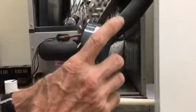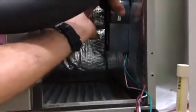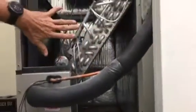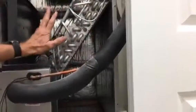What you could do is come over on this side and drill your hole. You'd have this self-cleaning unit inside — as the airflow comes up through here, it'll hit this goal-post design and go through. This unit will actually clean the coil all the way through, penetrating and cleaning both the backside and front side of the entire coil, where your conventional UV light doesn't.